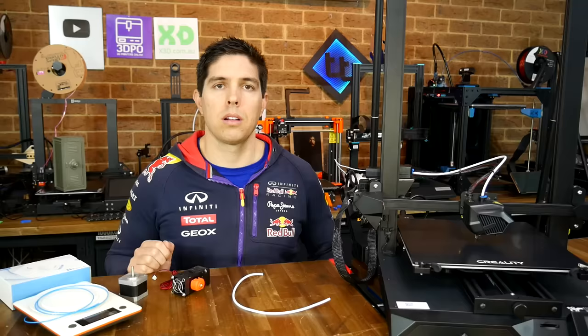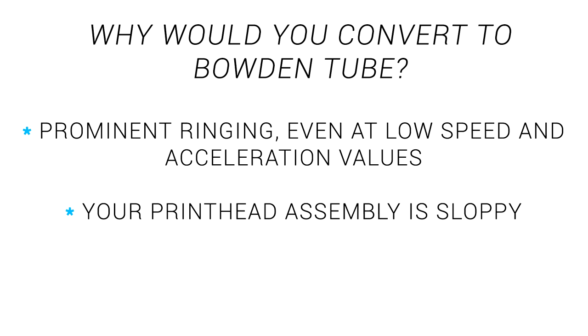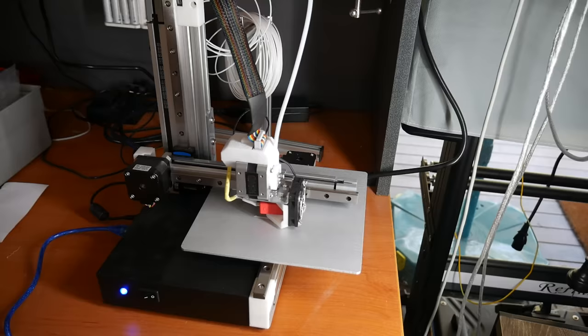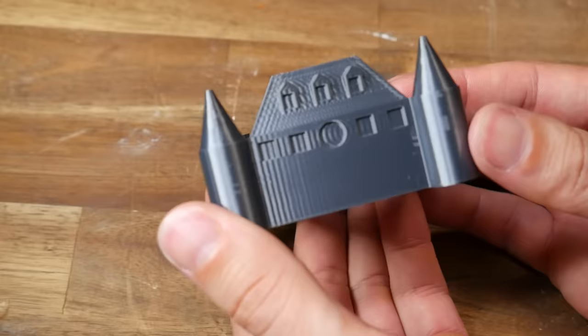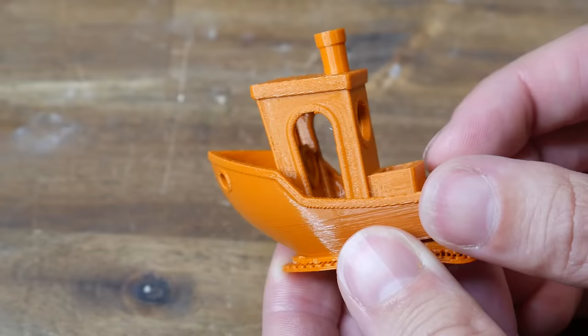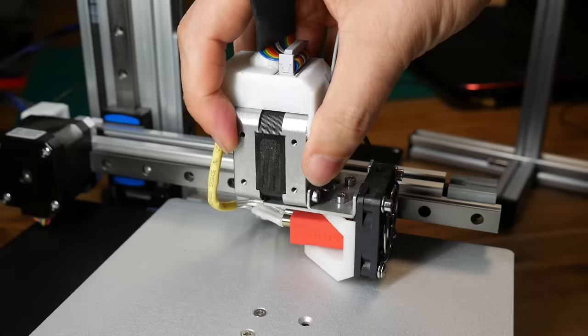We can modify the printer and convert from one to the other. It's nowhere near as popular, but why would you convert from Direct Drive to a Bowden tube setup? In my opinion, the ideal candidate is a printer that already suffers from a lot of ringing, possibly due to the printhead having a lot of play. One such printer I've tested was the Cetus Mark III — it's direct drive and it's lugging around a pretty big stepper motor. Despite using linear rails, this printer produced the worst ringing artefacts I've ever witnessed, even showing up on a 3D Benchy at pretty slow print speeds and accelerations. Inspecting the assembly gives us our answer — there's just way too much play, and I think this would be an ideal printer to convert to Bowden tube.